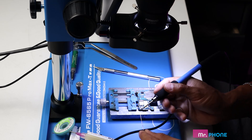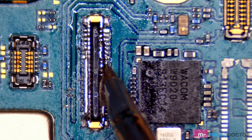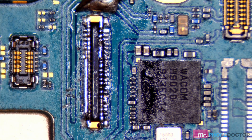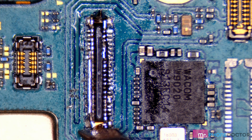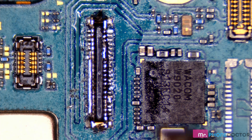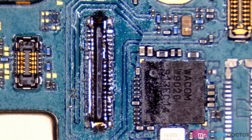I took all that excess off. I'll add just a little dab more, and I like to get the grounding areas as well. I did use a little bit too much solder to tin these edges. I'm not going to be reusing this FPC, so it should be okay. If you're planning on reusing the FPC, I recommend using a lower amount of solder so you don't contaminate any of the main components.